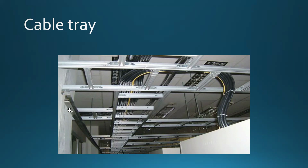Yes, this is less expensive to buy. Yes, this is more expensive to buy. You spend much less time assembling this. You spend much more time assembling this. So you gotta find what's your happy medium. Personally, I think this is much better way to go. Things do look more professional. Actually, you can make the strut look more professional, but it takes way more time to install this than the tray.